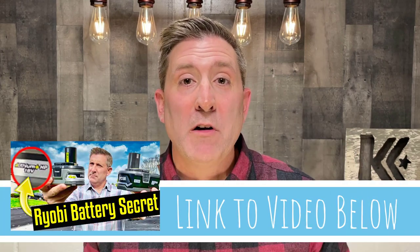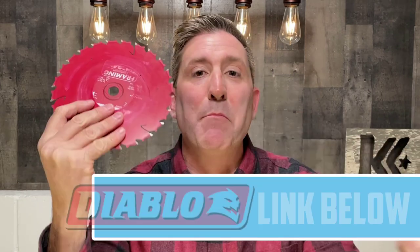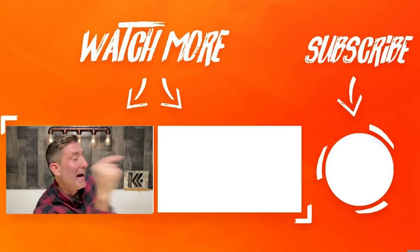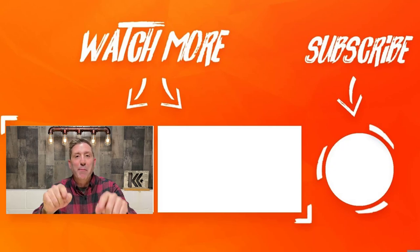In the future, I'm definitely going to listen to you more. The reason I did this test today is that many of you, when you saw my other Ryobi circular saw reviews, said: 'Andrew, throw out that stock blade and go with the Diablo blade.' And based on my tests today, that's a good move. The Diablo blade outperformed the other two in cut speed and cut quantity. The other blade — this one — should stay at your grandfather's house. There's also a video where I review different Ryobi circular saws and batteries. Let's go.